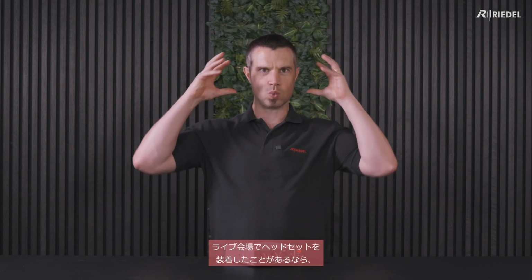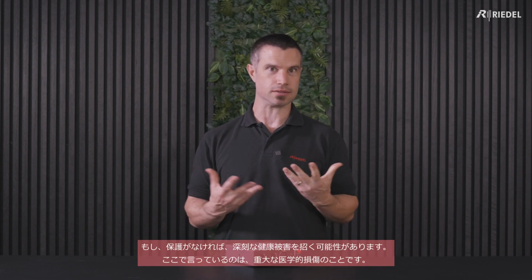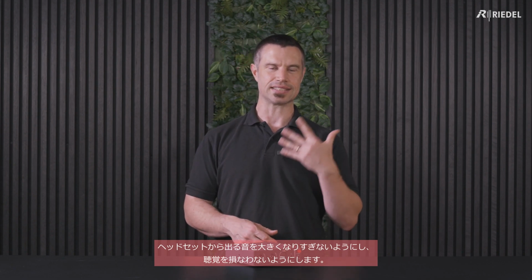Now, if you've ever worn headphones in a live environment, especially in a kind of rock and roll environment, you'll know that sometimes you can get feedback, and that feedback can go into your ears, and if you don't have some kind of protection, it can really damage your ears, and we're talking serious medical damage here. So by having a limiter on the output, we can also ensure that that output level from the headphones doesn't go too loud and damage the hearing.